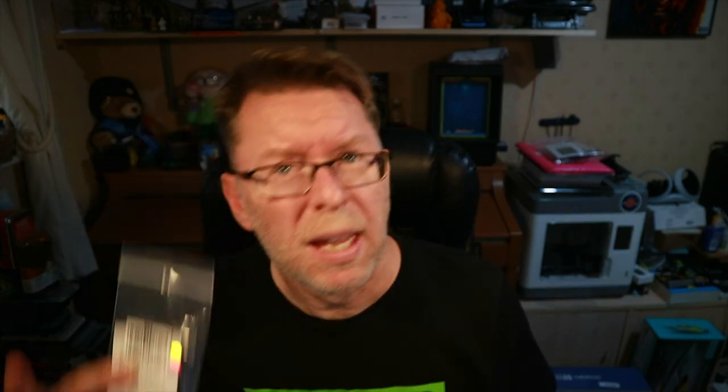I had to convert my old R9 module and receivers to ExpressLRS before, but now we have proper purpose-built receivers. They've released the BR1 and the BR3. The BR1 comes with a Y antenna attached and includes a more robust antenna better for zip-tying to a quad frame, plus wire and heat shrink for soldering. It has 50mW telemetry power and is a good all-round five-inch receiver. The BR3 is a diversity receiver with two antennas and a whopping 500mW telemetry power - configurable from 100mW to 500mW via the Lua script.